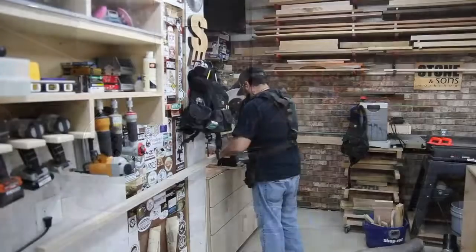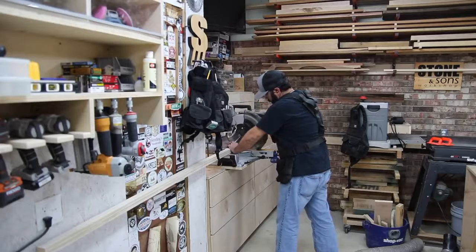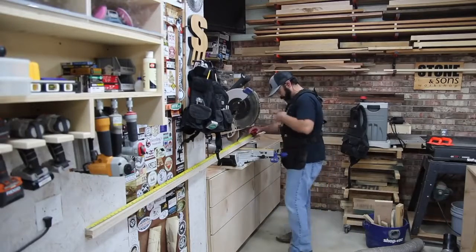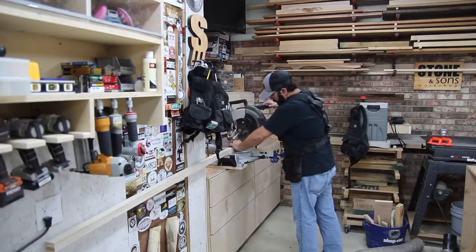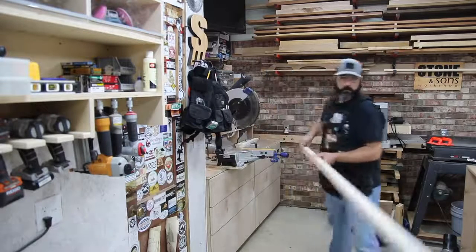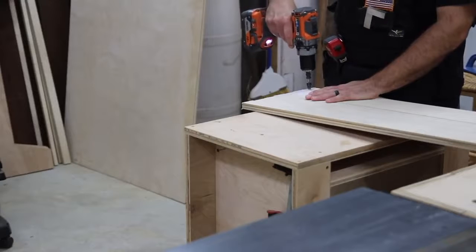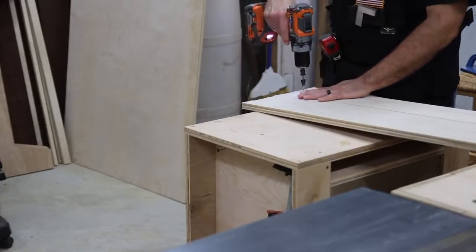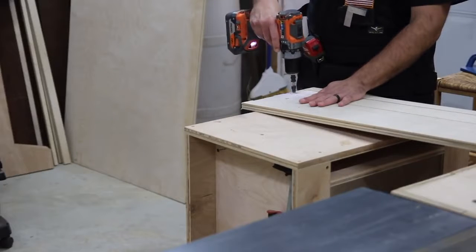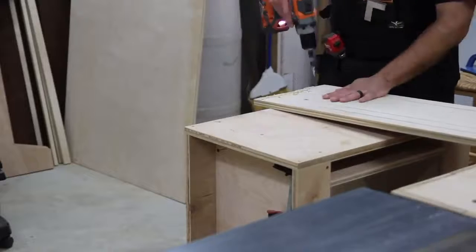With this particular style I'm making the four outside pieces — the two ends and the two sides — but there are also going to be some internal parts. I've cut down on the table saw a bunch of strips of plywood and I'm cutting them to length. This is going to create an internal section of the bed underneath for support, kind of where the slats go. I made a big mistake here and drilled too many holes in too many of the pieces — these are for the rectangular support piece, but I went ahead and drilled holes in everything, which I didn't mean to do.